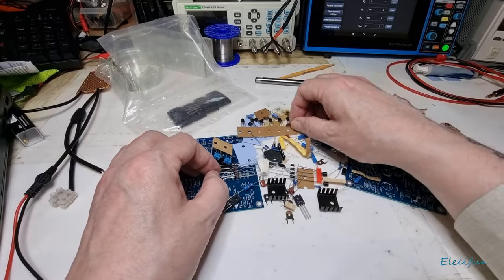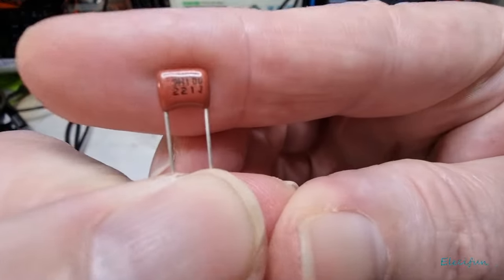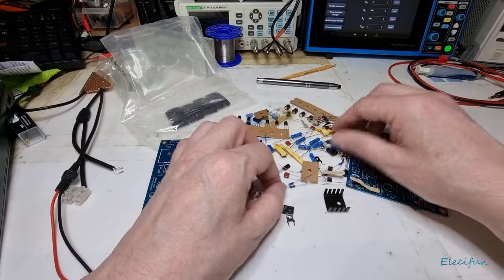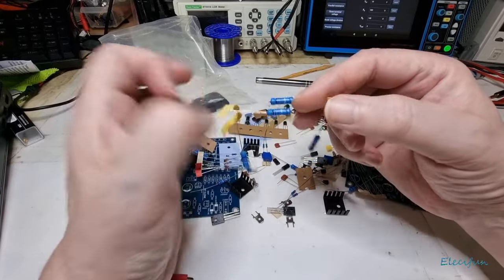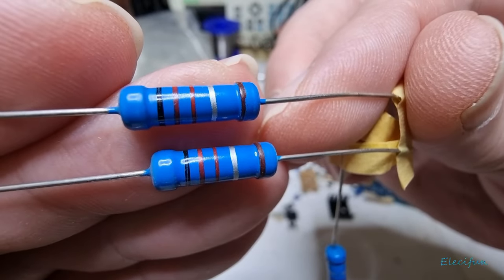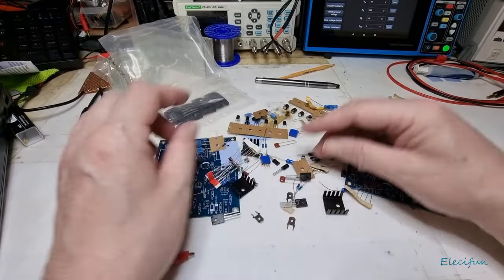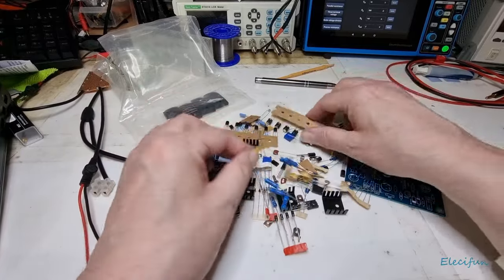Now what I did notice in the imagery was there was a bunch of those round two kilovolt capacitors, but they don't have any here. I think they've exchanged them out for these film capacitors, which is pretty good. They do look nice and colorful. As you see sometimes on some of these things the colors are half-faded already or rubbed away - that's never a very good sign. So we're going to say that most of this should be pretty okay.